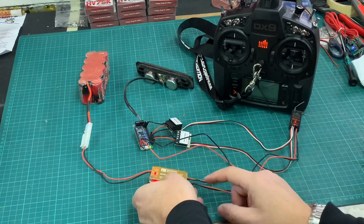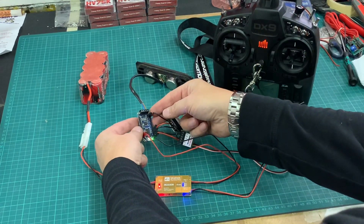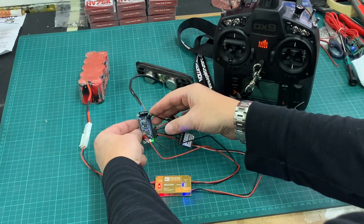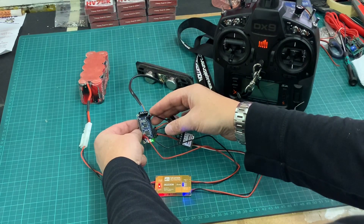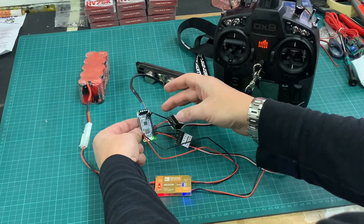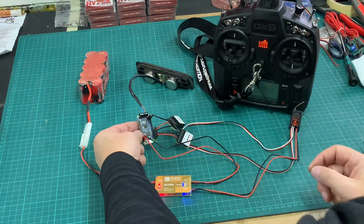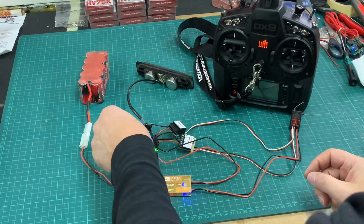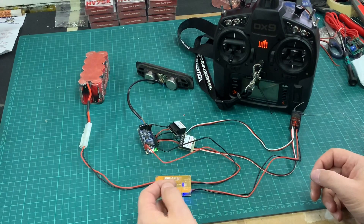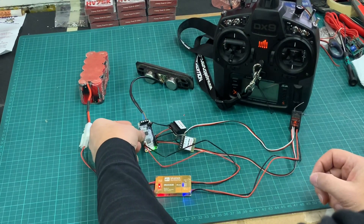At the moment the soundboard is only 2 watts, which probably isn't loud enough for R2. I'll try it in the droid first, but you'll probably need an amplifier — you can get a small version by the same company. This is the Adafruit MP3 player, the speaker version; you can also get a jack plug version if you just want to plug a normal speaker into it with a built-in amp. There's a 2-megabyte and a 16-megabyte version — I'd recommend the 16-meg, as 2 meg is a bit too small for your sound files.